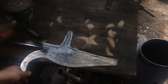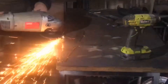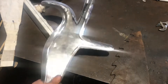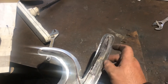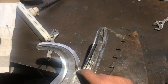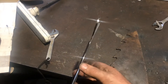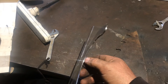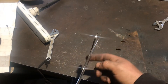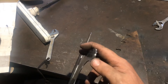I've gone around with the first pass and it's not looking too bad. I've gone a little bit over my line there but I'll be able to clean that up. I need to get into here but I'll use a different tool — I nicked it a little bit deep through here so I need to watch that carefully, especially on the inside. At the moment the edge is sitting at about 2.5mm, so I'll do the same to the other side and then go back around the whole edge until we've got a 2mm edge. I'm leaving the ends quite chunky because at the end of the day it's going to hit somebody and the more material there the better.